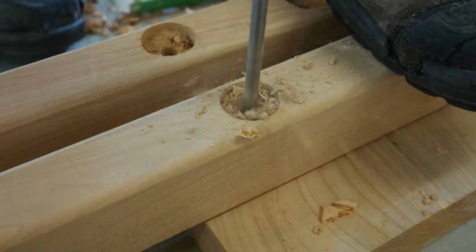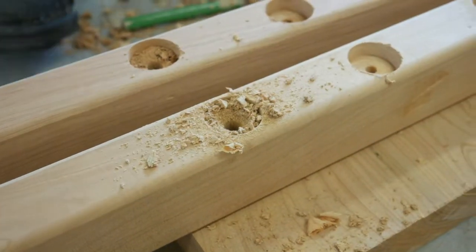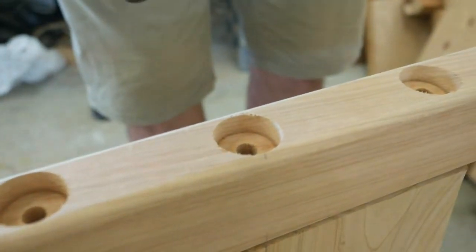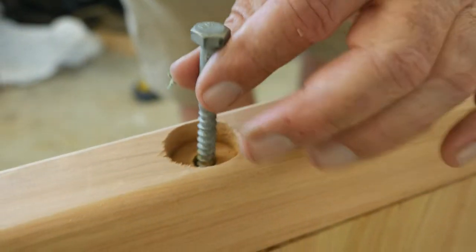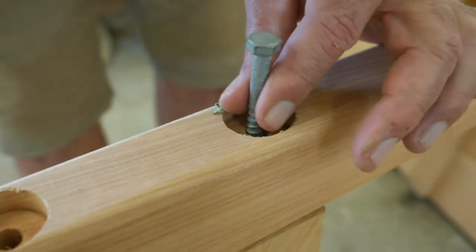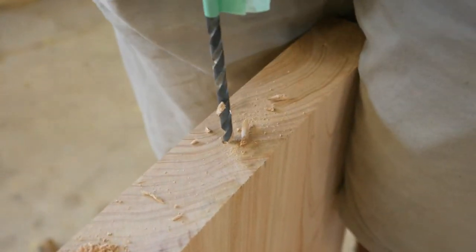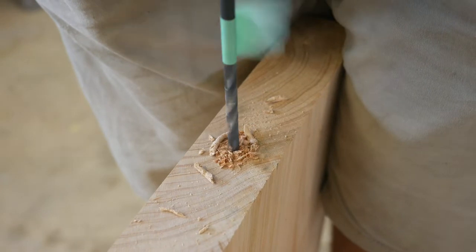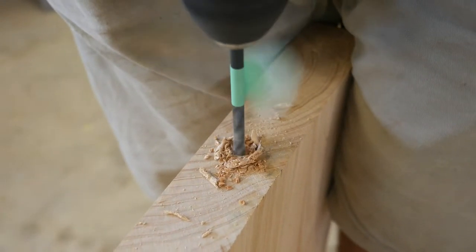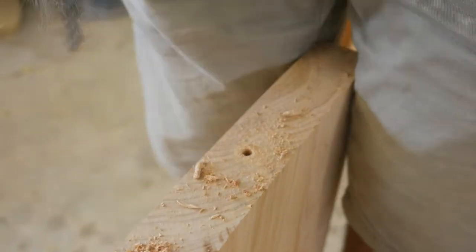Just drilling right through now. And because we're using M10 coach screws, we're actually drilling a 12mm hole through there so that it's totally loose through the first part. That way it won't bind as it's going through, and then it can screw up nice and tight up into the end grain of the 290x45. Just marking the positions there, and again using our 6mm 150mm long drill, doing a nice pilot hole. So that's so the M10x150 coach screws can screw into that pilot hole.